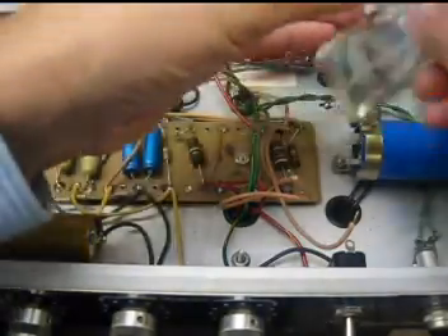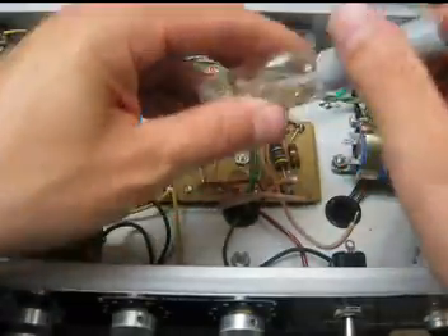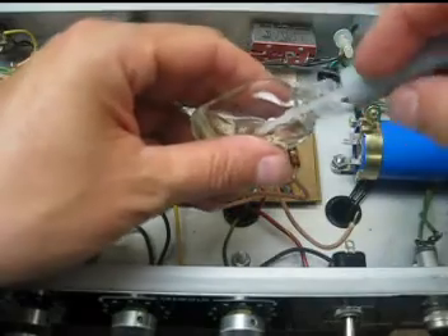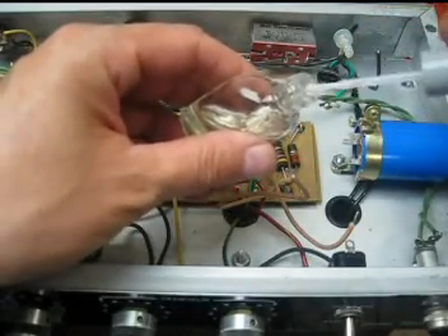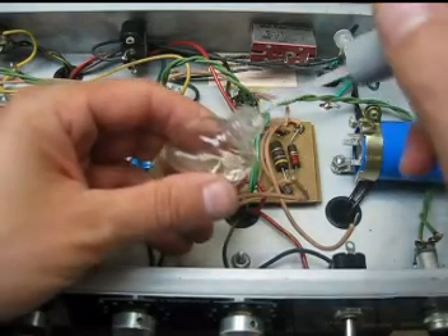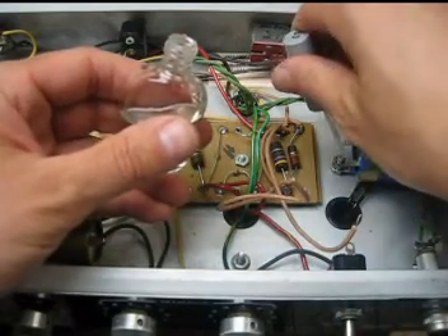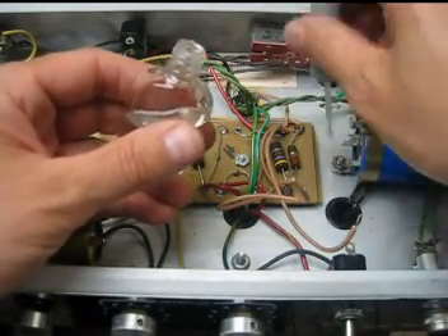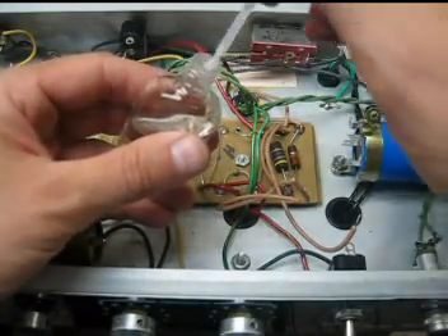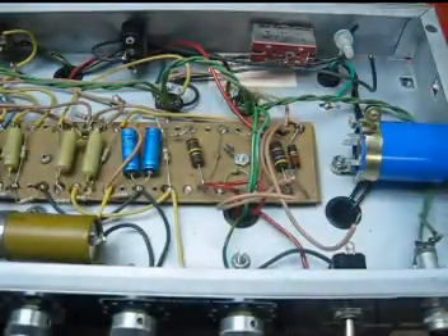One other trick — this is ladies' clear nail polish. It's useful for many things, including repairing guitar finishes because it's actually a nitrocellulose lacquer. But it's also good for making sure your bolts and nuts only come off when you want them to. It'll set up nice and hard, but not so hard that you can't break it with any tool.